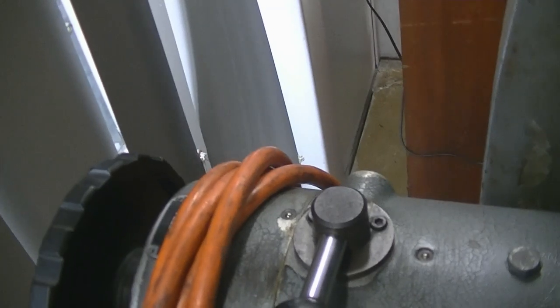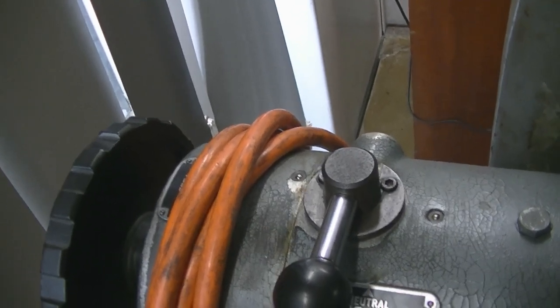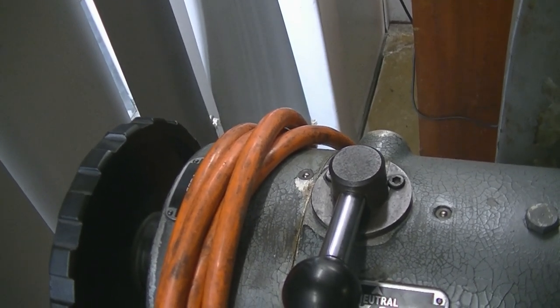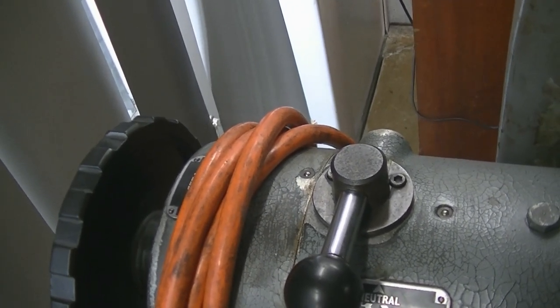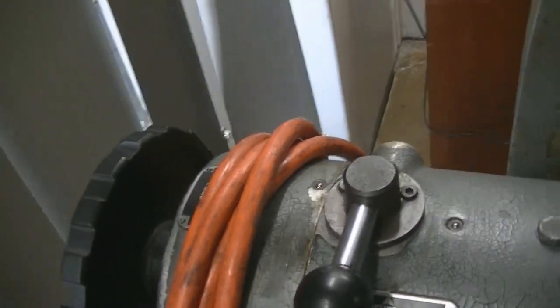Before I start the main video, here's a quick look at the top of the gearbox for the feed for the facing slide. You can see two little button oilers — that's the only way the top differential gears get their lubrication. If they get stiff, the differential action just doesn't happen. So make sure you lube those if you've got an old model like mine.